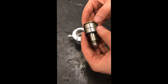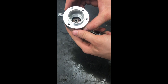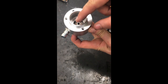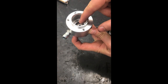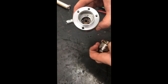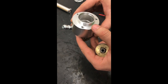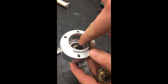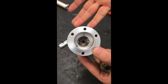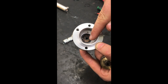If we take the shaft removed from the bearing covers and look inside the bearing housing where the shaft will sit, we can see a little hole on this side and a little hole on this side. This one is the bypass — if the seal fails and for whatever reason the water doesn't pass between the two ceramic faces, the water will escape out the side, go down through that hole, and out the telltale hole shown earlier. That's how you indicate that the ceramic seal or the o-ring on the top of the inlet kit has failed.